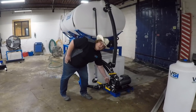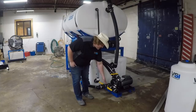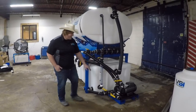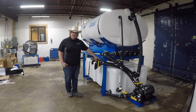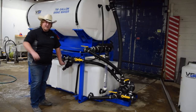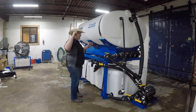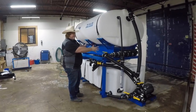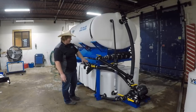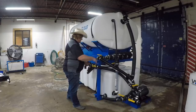Always make sure you're only pulling from one place. Remember, the lower side of the pump is the suction side and the high side is the pressure side. So now we're drawing from our storage tanks into the pump, and it's going to come up here to the same fill station we talked about filling from earlier. Now if we open this valve and we have our connection into our truck, we're filling from our storage tanks. What we've done is completely isolated the brine maker — nothing besides the pump motor and the fill line is being used, agitation's off, tank suction's off. We're just pulling from your outdoor storage tanks into your pump and up into your fill line.